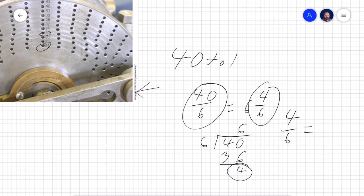I want to turn that four-sixths into an equivalency fraction. Six goes into 24 four times; four times four is 16, so 16 over 24 is one equivalency fraction. Six goes into 30 five times; five times four is 20, so 20 over 30 is another one. So I pull the plunger out, rotate around six full turns and then four-sixths of another turn — which would be either 16 holes on a 24-hole plate or 20 holes on a 30-hole plate. Both of those work. That's how you use the division method.